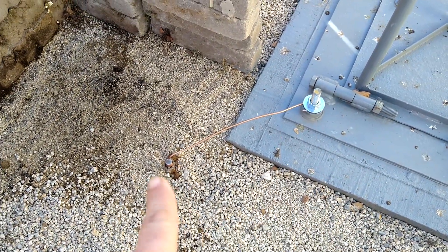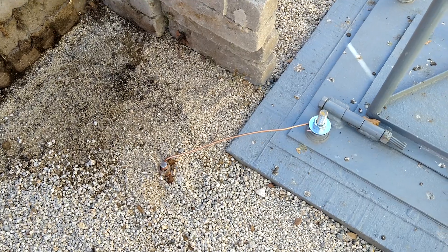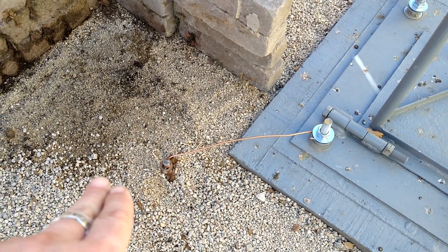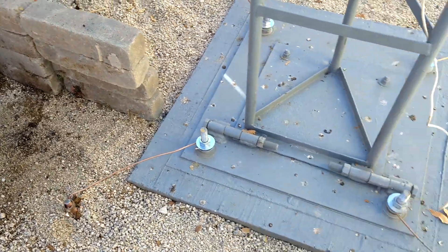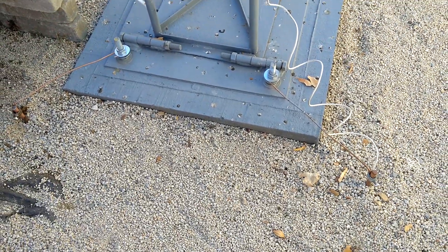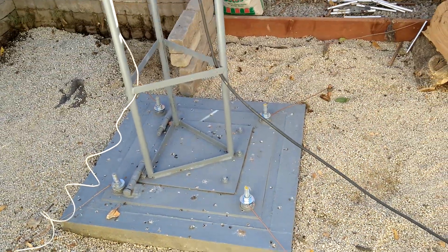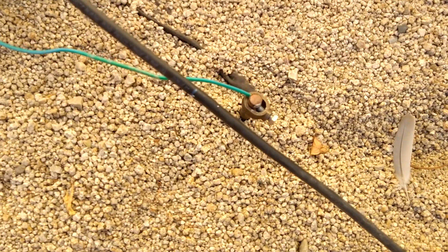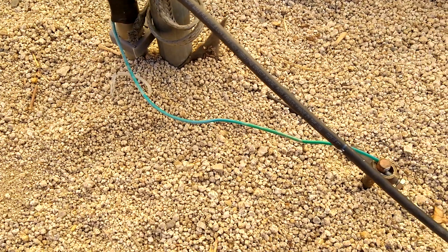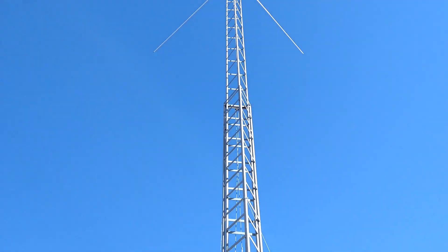I've checked for connectivity with all of these with a multimeter to make sure I've got it at each bolt on each ground rod — I've checked cross this, cross that — so everything's grounded. Those are eight footers and all I can do is help, right? More ground the better. And then from my actual equipment, this here's another eight foot ground rod all the way down in the ground — that's my equipment ground right there. Hey guys, thanks for watching, have a good one.